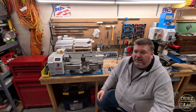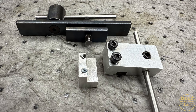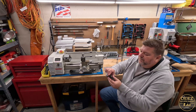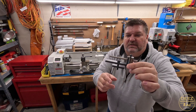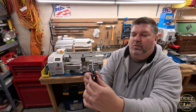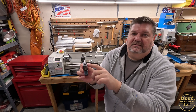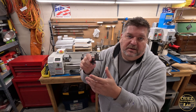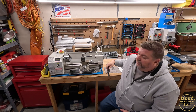I made two styles of it. This was my first option — just a couple pieces of flat stock. You can see you can mount that on the lathe ways bed. This piece here will pinch it up underneath, and then you can rotate this upright to push against the carriage and stop it. This works very well, but I went ahead and made a different style which I actually use all the time.